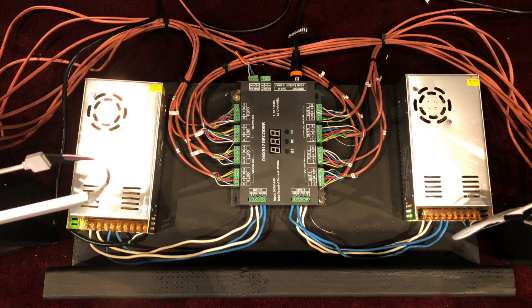Here's the thing — you actually have to wire in your own power supply. The dimmers don't have a power supply. This is going to convert the normal 120 AC volts that comes out of your wall into a 12-volt DC current, which is what the LED tape wants. This power supply breaks out power to three separate devices, but the dimmers actually want four. So you can either run six of the eight channels on the dimmer with one power supply, or if you want to run all eight channels like we do, you need two of these power supplies. With this center section, we evenly distributed the power — each power supply sends power to half of the channels on this dimmer.